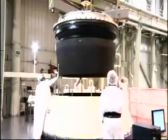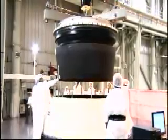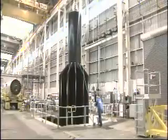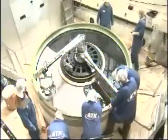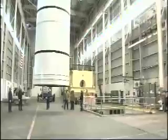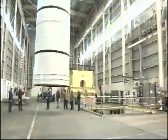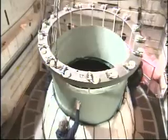Placing the O-ring in the aft nozzle, then lowering the nozzle down into the aft segment. So critical that all seals are kept. This is a piece of propellant core tooling — notice the 12 fins — and there's propellant dropping into the rocket motor. The pinkish material is the cured rocket motor propellant, which has the consistency roughly of a hard rubber eraser. It's cast in and cured at a high temperature as a liquid with the consistency of approximately peanut butter or cookie dough, and then it becomes a hard rubber.